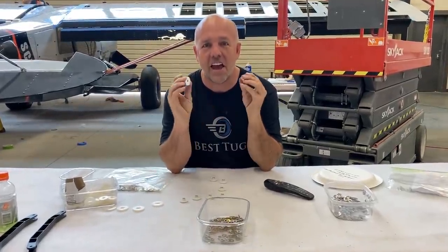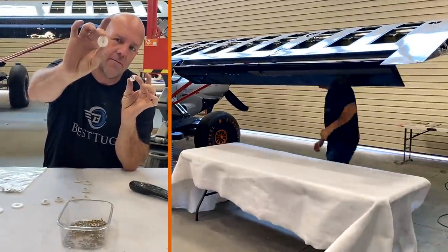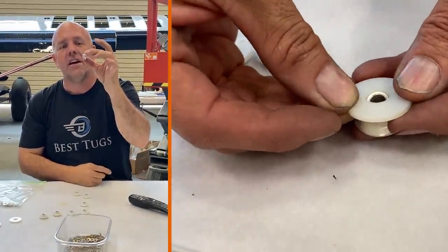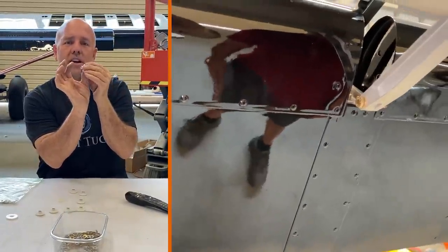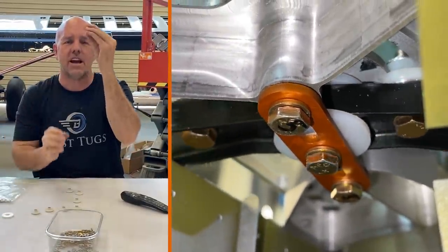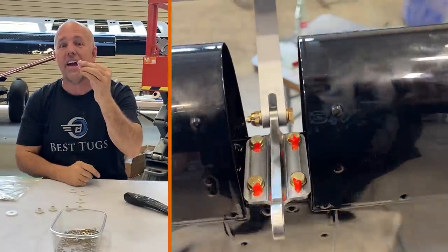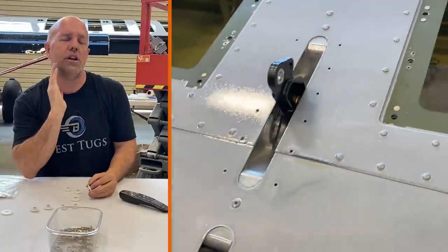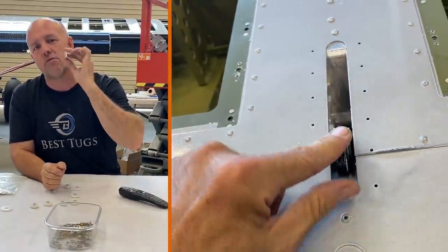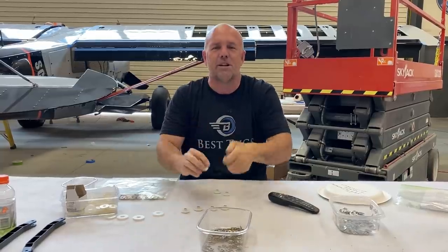What we're doing now is finishing connecting the aileron pivot assembly. Everything is obviously ball bearing. I've made little spacers and custom nylon washers. The aluminum spacer rides on the bearing race where it can pinch and keeps everything square and true. However, if the bearing were to go bad somehow, this is the secondary fallback — everything then rides on a nylon glide. You wouldn't even know it went bad unless you inspect during annual, where you'd find just the slightest play, but the nylon would still track perfectly. Let's get all these aluminum spacers and nylon backup slides installed.